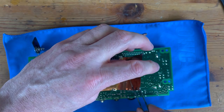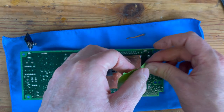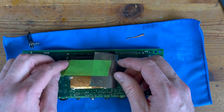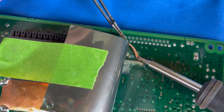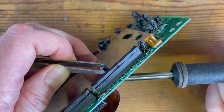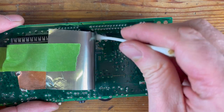At the time I didn't have a desoldering gun so I just melted the solder and lifted up at the same time with a pair of tweezers, and once I was able to pull it back I held it in place with a bit of masking tape. I do have some braid so I'm just going to flow this and try to desolder using the old method — it was a bit of a pain but I got it out.